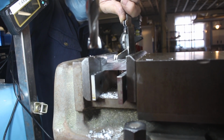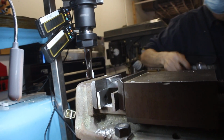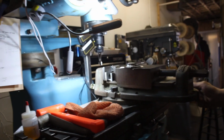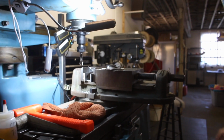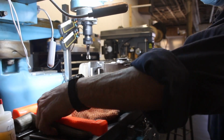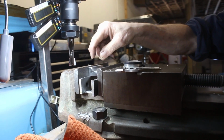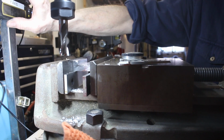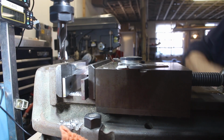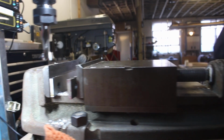The other advantage of working this way, you can take the piece out of the vise anytime you want because there's no zero has been set up. Because it's such a simple piece, you mean? Yeah, well, you saw that other piece I had in here, the drill jig. I had very carefully zeroed this whole system on the corner. But I didn't do any of this. So there's no reference that's been made for this machine, so you can pull it off and measure it. It's too hard to measure the thing in that vise.